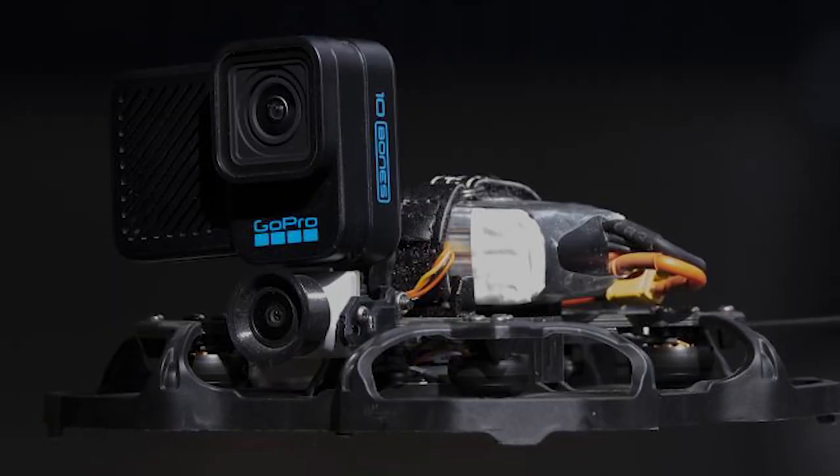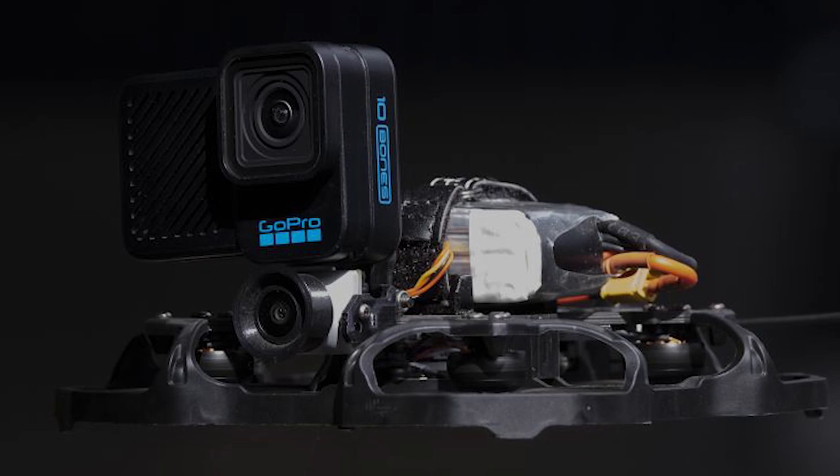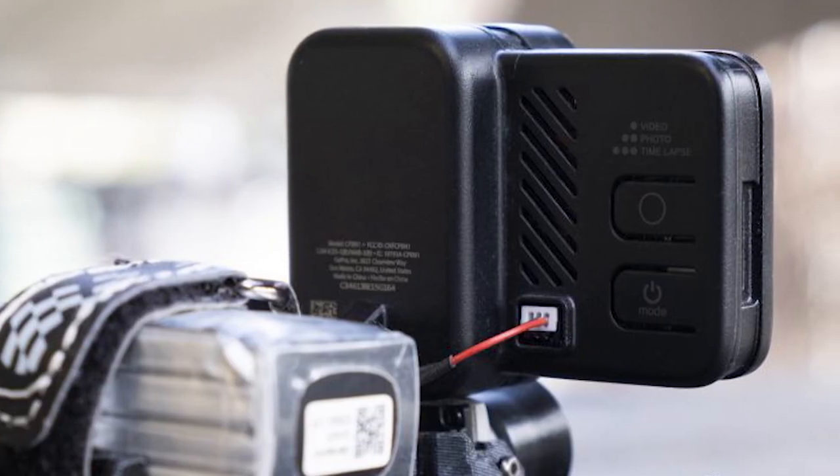Plugging the Bones into a drone and mounting it safely involves a little more tinkering than your average GoPro. On the back of the camera is a socket for a GH 1.25 3-pin connector, which connects to both the battery and also your drone's flight controller. You can also mount the camera pretty easily using a single screw boss, or on larger drones, the included adapter for GoPro's existing mounting system.